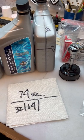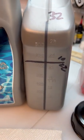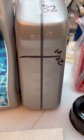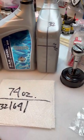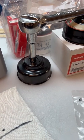Here's what you need for changing your oil on a Honda outboard. You need your oil — do the conversion: two quarts plus 10 ounces. Mark a line with a Sharpie so you don't make a mistake. Use a cap wrench to remove your oil filter.